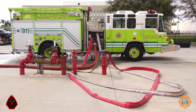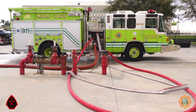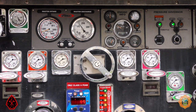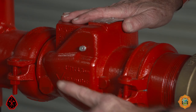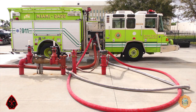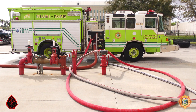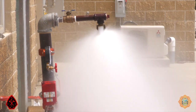If the fire department pumper pumps into the FDC below the pressure that is in the system, it will be unable to force open the one-way check valve that is downstream of the FDC. If, on the other hand, the pumper exceeds system pressure, it will force open the FDC check valve and close the check valve on the discharge piping of the building's fire pump. Usually, fire departments pressurize FDCs as a precaution in the event that the building's fire pump fails or the sprinkler system is overwhelmed because it is flowing more sprinkler heads than the system was designed to flow.